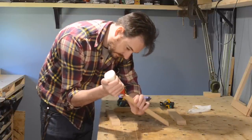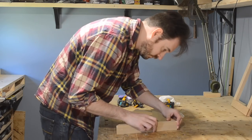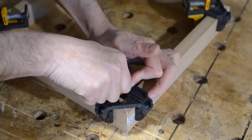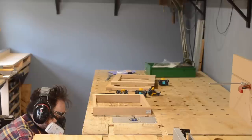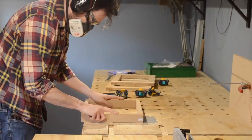If you have a rebate like in a picture frame, you have to cut one 45, then set the saw up for the second 45, and then again and again, with a little waste piece in between. This way you can just flip the work piece over and keep making cuts with no wastage. I thought I was being very clever, and I left that overnight to dry in the Wolfcraft clamps.